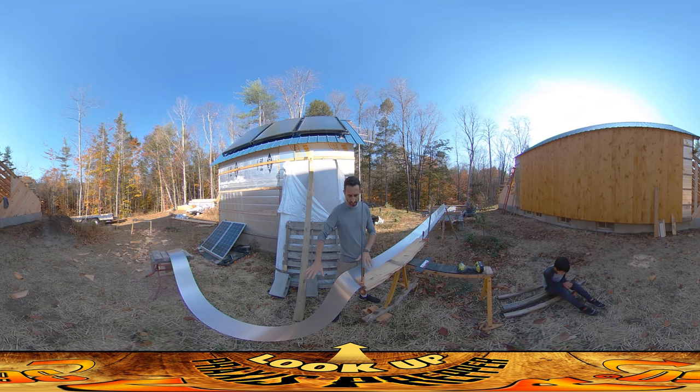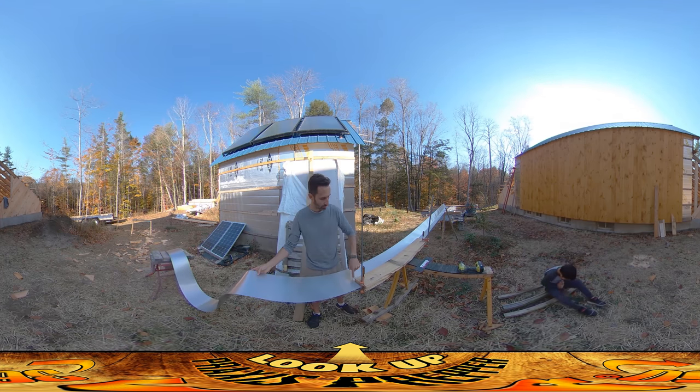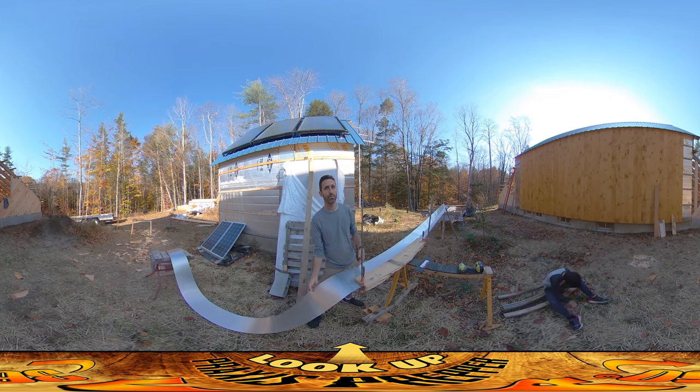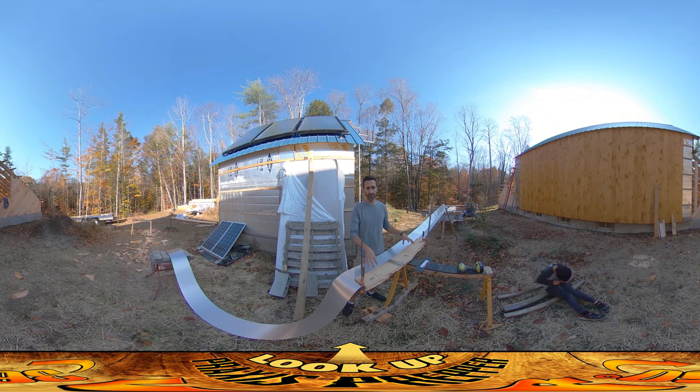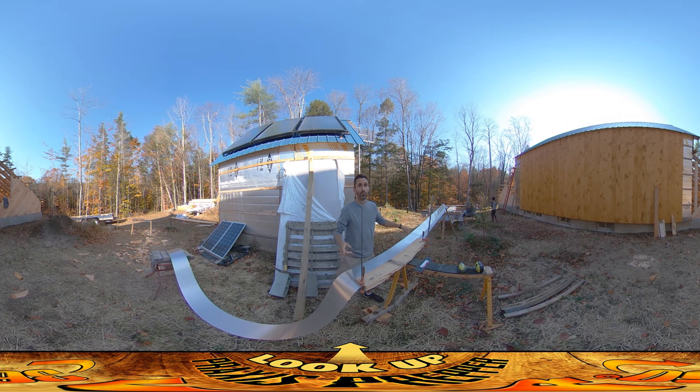Last time as I was moving the piece of metal through, I had to worry about the alignment of the metal — I have marks every couple of feet that are four inches from the edge so I know where to pinch it. I also had to worry about the top board being free-floating, and it became ambiguous whether the top board was lined up with the bottom board. So I added two screws in the back, but intentionally made a little gap so that when I clamp from the front, I get a really tight squeeze right at the tip, which is where I want it.